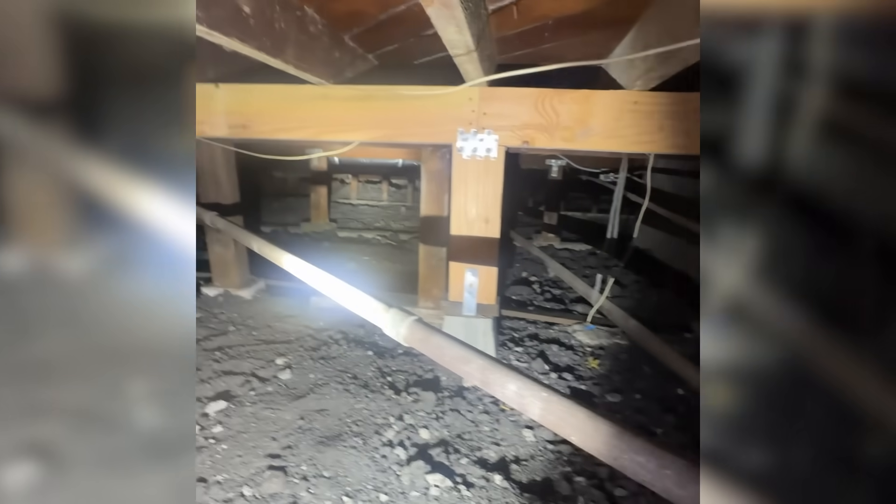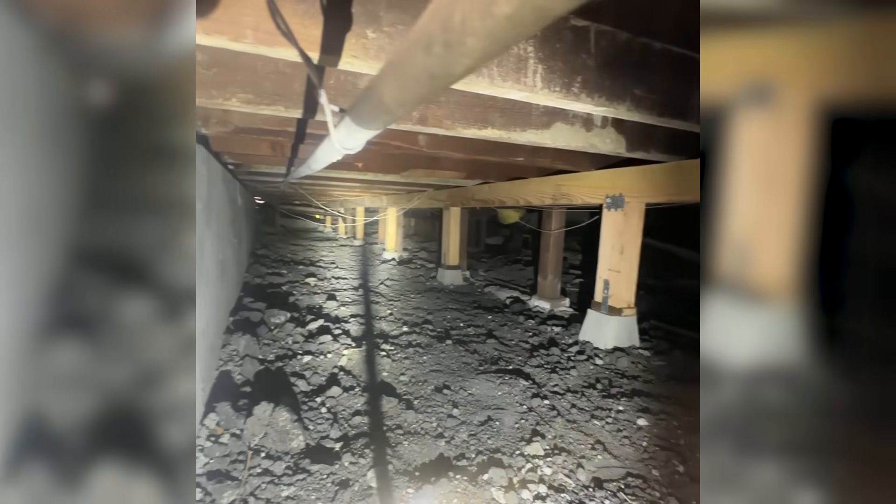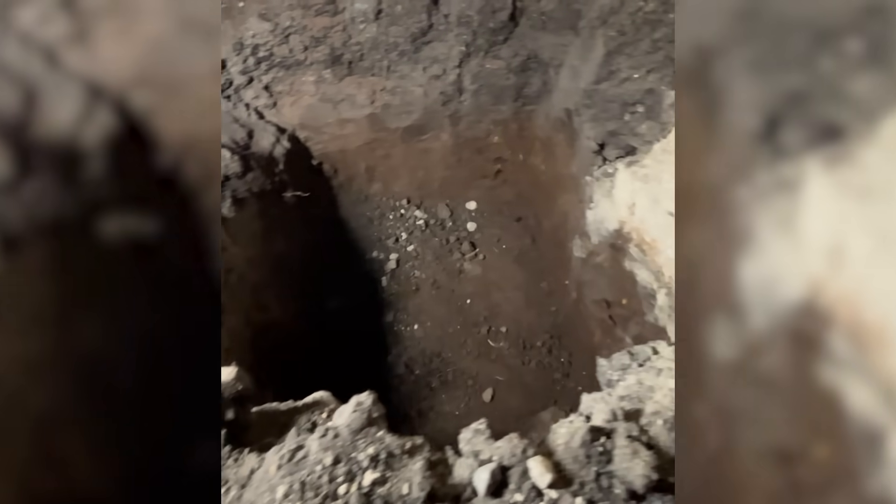We also installed about 50 feet of new post-pier and beams with approximately 20 new post-pier foundations. That's going to bring this house up to seismic codes for today's current standards in a clay-based environment. We installed deeper footings, steel-reinforced concrete foundations, fully anchored to the floor system, so now this house is seismically built up to current codes.